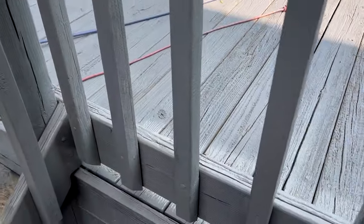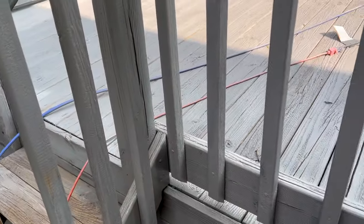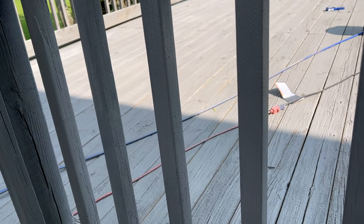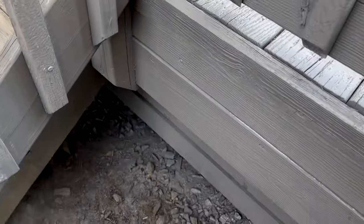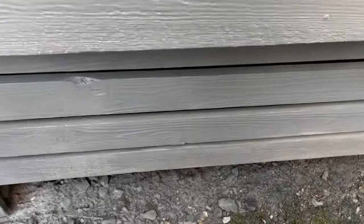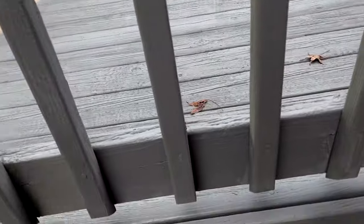One cool feature is pressure control. If I have the pressure turned way up while painting the pickets and I'm getting a lot of overspray, I can turn the pressure down and really reduce the overspray so I'm not wasting product. Right now I've got it set at mid-range because I want to cover a lot of distance, and when I'm on the pickets I'm moving really quickly and staying up close to reduce overspray.